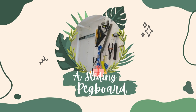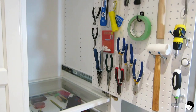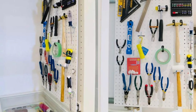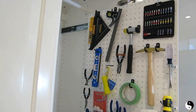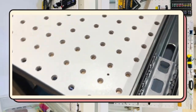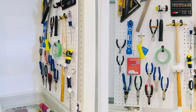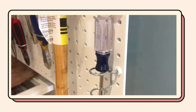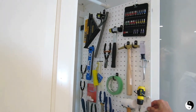Number 3: An Interesting Sliding Pegboard to Declutter Your Kitchen Utensils. This DIY project solves clutter issues by hiding the visual chaos of hanging tools behind cabinet doors. The sliding pegboard tucks away inside a cabinet and slides out when needed. To make it, cut and paint the pegboard, glue furring strips to the back, and attach drawer glides. Mount spacers on the pegboard sides and attach to the cabinet with screws. Arrange tools using different shapes and sizes of pegboard hooks, and use heavy-duty double-sided carpet tape to keep the pegboard from shifting or falling.